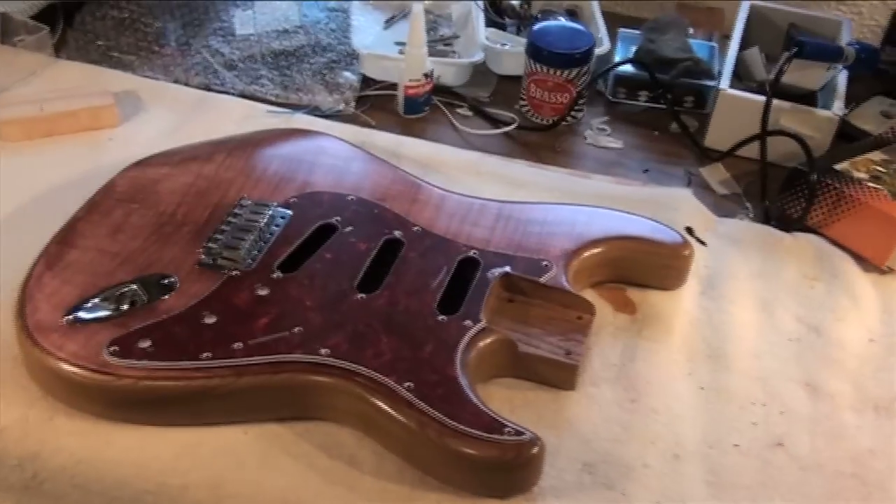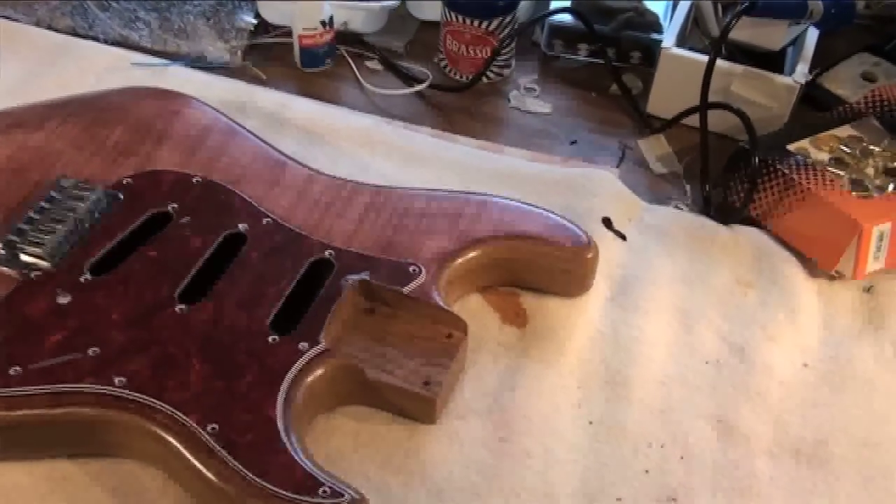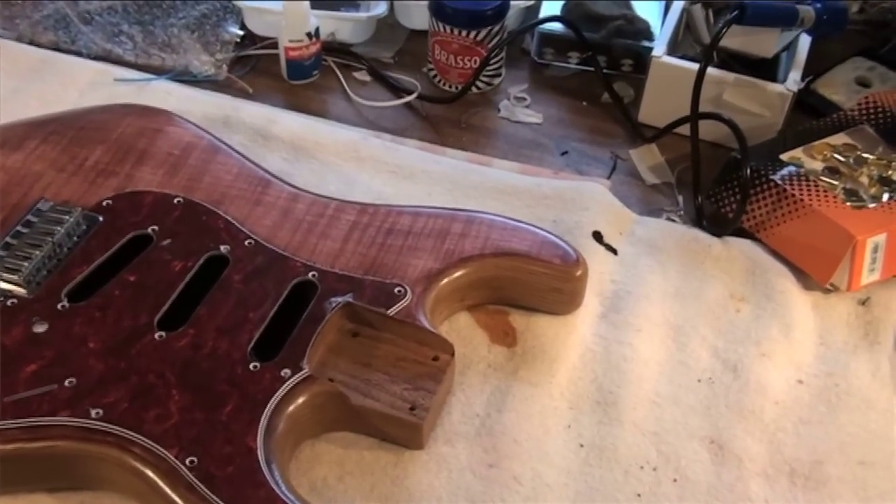It took me about a week and a half, and I'll tell you now it's really all in the prep. You really, really, really need to rub the wood down carefully, because unlike paint which would kind of conceal marks, the oil brings out every single flaw. It was the extra prep that I didn't realise I was going to have to do that really took the time — that and putting on two coats of oil a day for a week just to get the kind of even finish I was looking for.